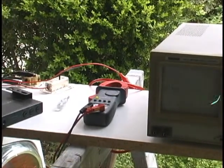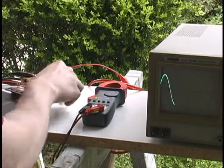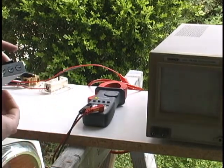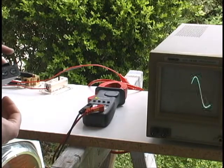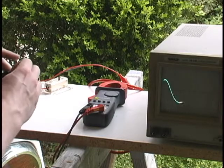This crossover has only a few settings. Basically there are three settings on the front. There's a frequency setting which runs all the way from 50 to 200 Hz — that's our low-pass. So we can go anywhere from 50 up to 200.